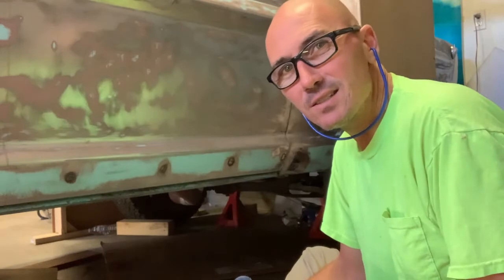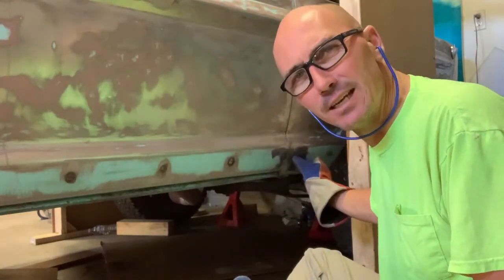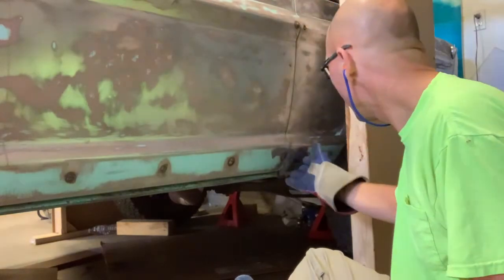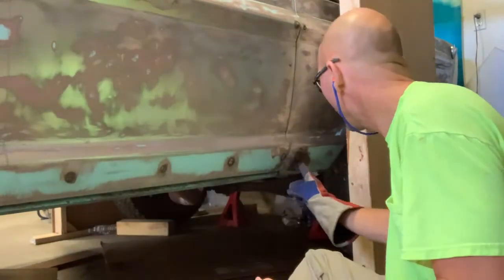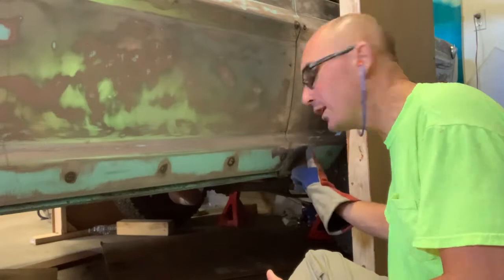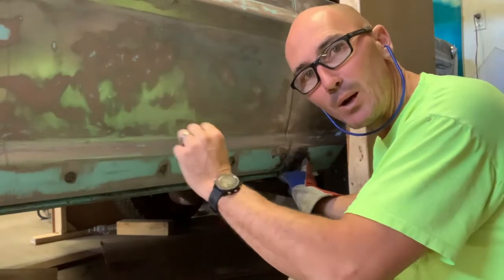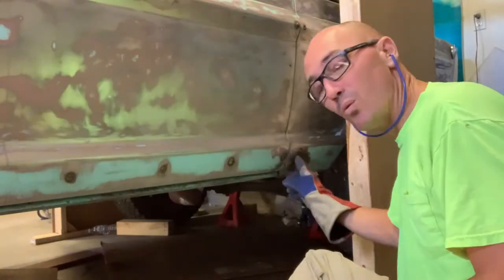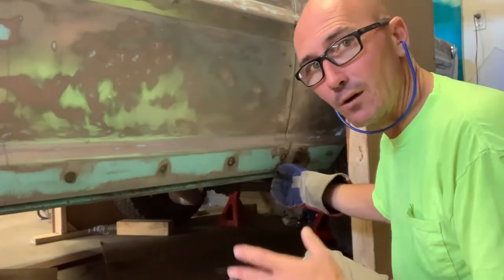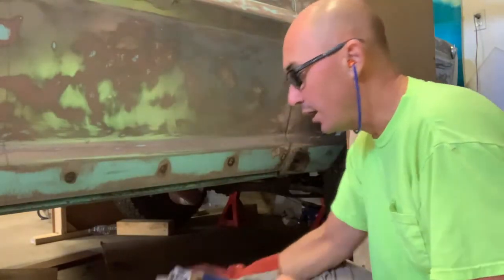One thing I might suggest is a lot like what I did when I worked with wood. Less pressure, just getting the sense of where the edge is hitting, how deep and how hard I can press. I know one thing for a fact: once you take material off, it's much harder to put it back on. So as you're doing your welding, keep in mind, this is one thing I've learned, the cleaner and smaller my welds are, the less difficulty it is taking it off and grinding it. But when I'm grinding, I'm being very thoughtful and careful not to push into the actual metal, really just focusing on the edge of the grinder.